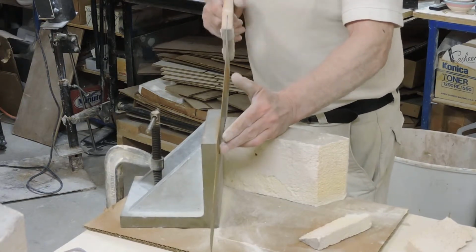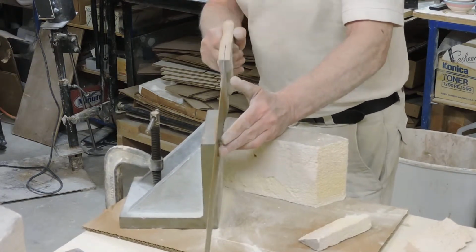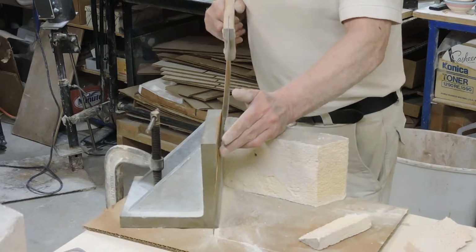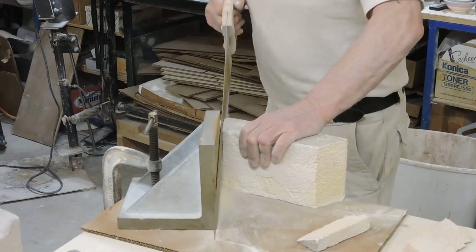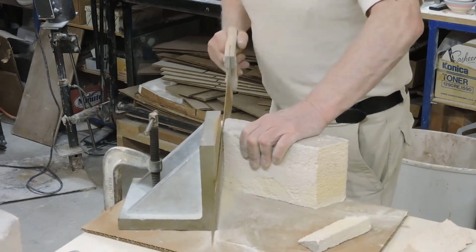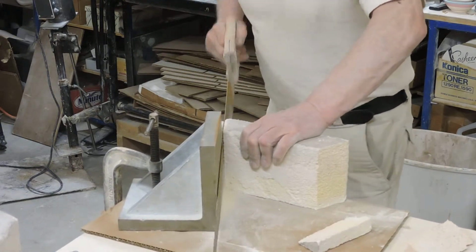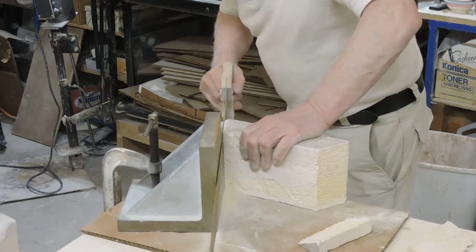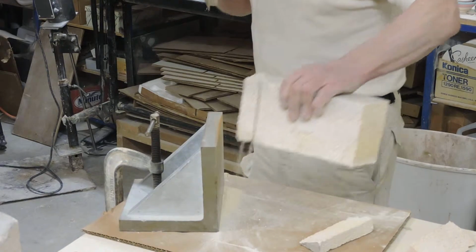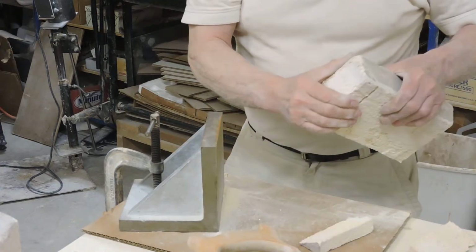This is just a cheap one I think I got at a yard sale. It's a little bit rusty and kind of a crummy saw, but it's perfect for insulating fire brick. Once you're going, then you don't need to hold it anymore because it stays in the groove. And it only takes a second then to cut the brick, and we have now the 7 bricks I need.